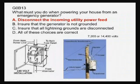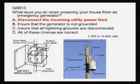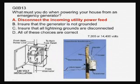Extremely important that you don't allow any of the energy from your generator to go back out to your line. And here's why. First of all, your generator is going to be seriously overloaded because it's going to try to run the whole neighborhood. The other thing is that when the service people come to work on that, they're not expecting to have electricity in that line. They're expecting it to be dead. After it's come up from your generator at 240 volts and gone through this transformer, it's at several thousand volts on these lines. You don't want to surprise the guy who's trying to fix your line by giving him a few thousand volts that he's not expecting. So it's extremely important that the power from your generator not get back into the utility lines.